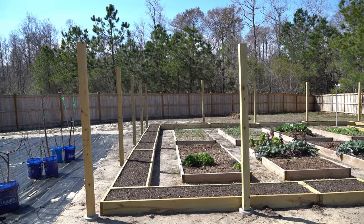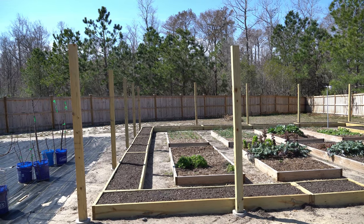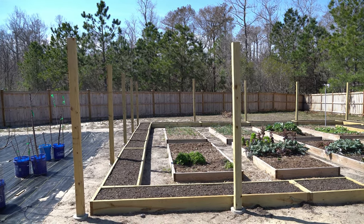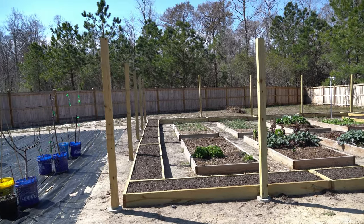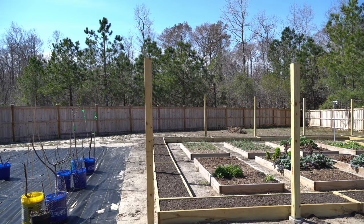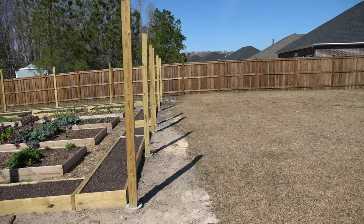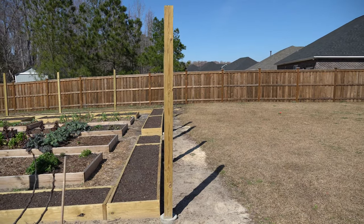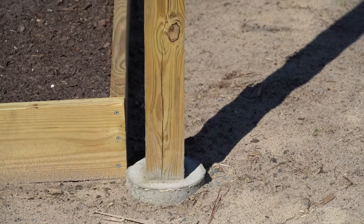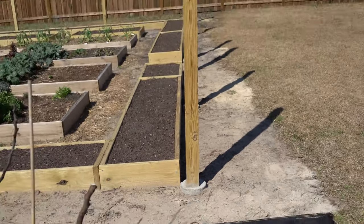Here you can see how everything came out. The beds are a little bit warped — that's pretty standard out of number two pressure-treated wood — but now that the soil has been placed inside, they'll slowly bow out and hopefully regain their shape, especially when the weather heats up and the wood expands. You can see how straight the posts are — they all mostly disappear in a straight line. Everything came out pretty accurately and I'm really happy with how my plan worked out. The concrete foundations look great, and because they're elevated, water will not intrude between the concrete and the posts, which should help extend the life of these wood posts.